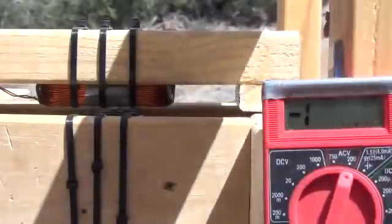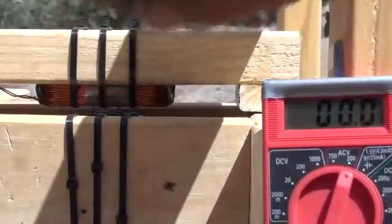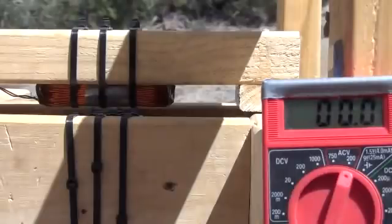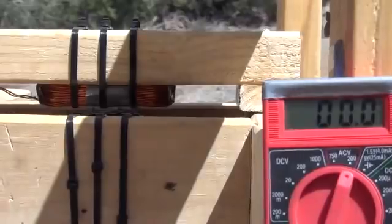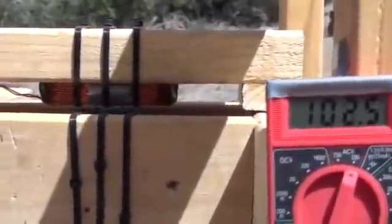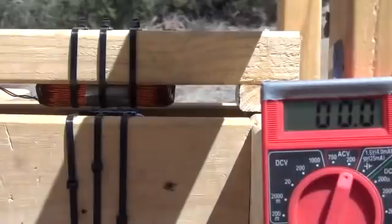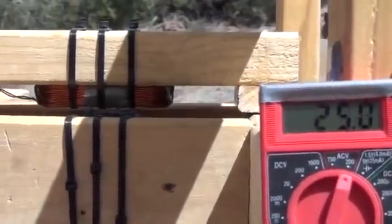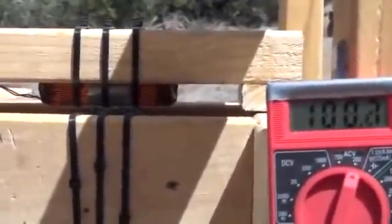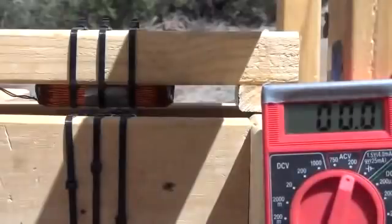I'm going to switch the meter on here — we are set to AC 200 volt max — and I'm hoping that shows up well. You won't be able to see much going on inside, but you'll be able to hear the thing rotating. Let's spin this and see what kind of voltage we're able to create. There you go — that should have been a pretty good measurement. I'm hoping you saw somewhere close to 80 volts. Let me give it one more rotation to make sure we've passed that 80 volt marker. So there's a brief demonstration of what four magnets and four coils can do at 2,700 RPMs.